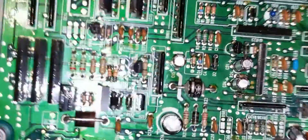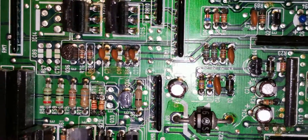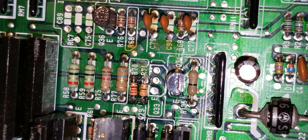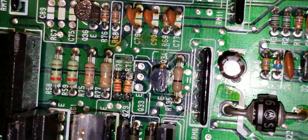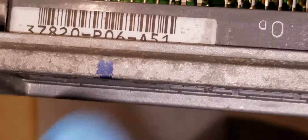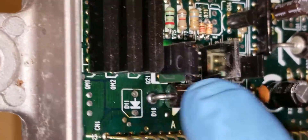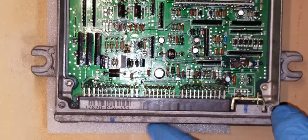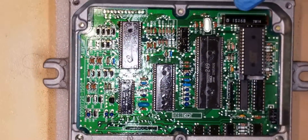After you install your D14, Q29, R70, and R71, take note of the resistor colors. Red, red, brown, gold is your R70. Orange, orange, red, gold is your R71. Be aware of the D14 strip going towards the plugs. The transistor faces the same way as all the other ones. That gets us done on the top left corner of the ECU — we're going to move straight across to the next area now.